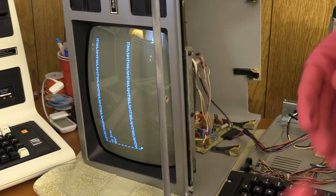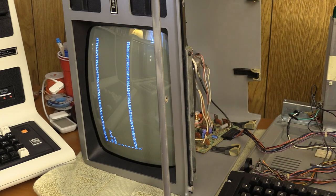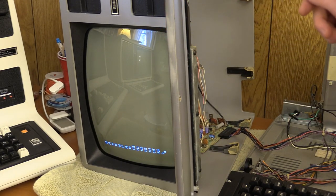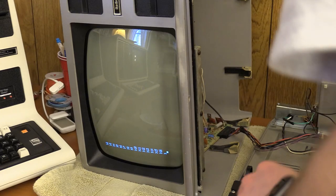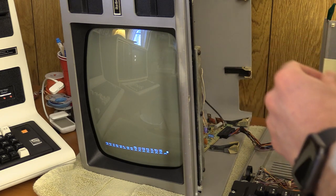I'm going to have to DeoxIT that. I think I'm pretty happy with the adjustments on this screen. Is it perfect? No. But as my first CRT, I'm going to say I'm pretty happy with it, and I can always come back and revisit it. The next thing we're going to do is a quick line count on the screen — one, two, three, four, five. I think I'm pretty happy with this. For my money, this machine is now working. I actually fixed a CRT. This is very, very cool. Let's put this back together, button the machine back up and take a look at it assembled in its glory.